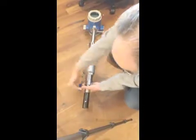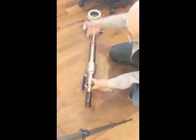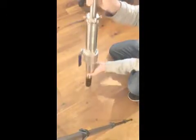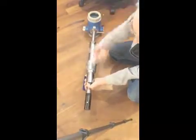So the flow wants to be going this way and you only need to insert it in the potable water this way. You don't insert it this way or that way. If you insert this way, air bubbles enter; if you insert that way, there's particulate in the pipe. So you keep a mag meter inserted from the side.